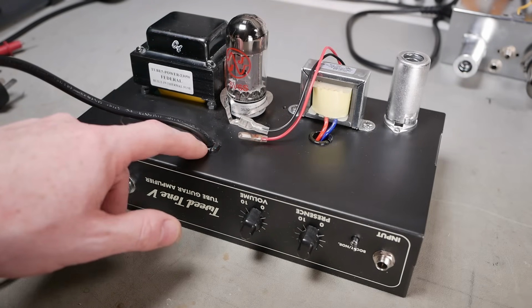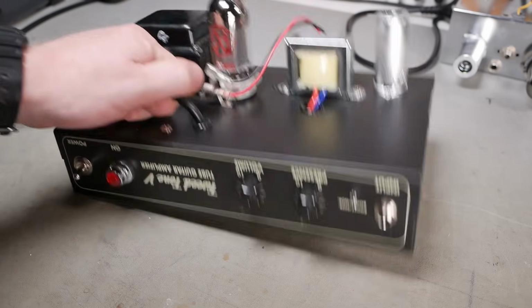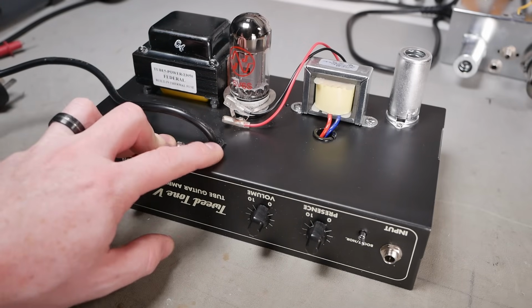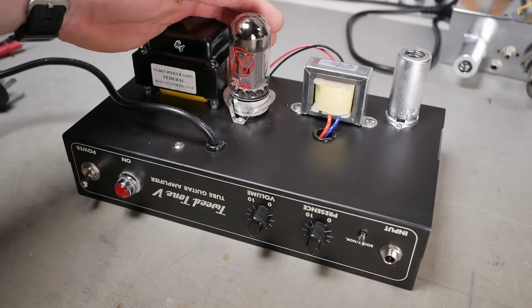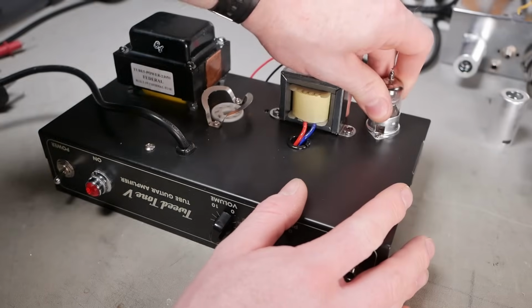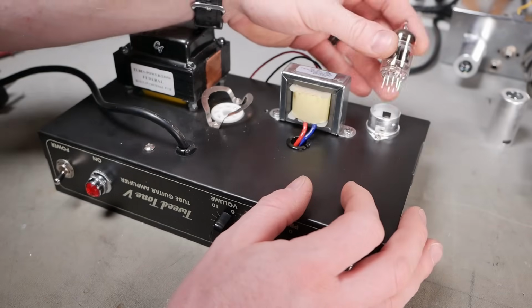Alright, so that's what the fillet out of the baffle was for. They've got a little strain reliever there for the mains. So they must have put that a little bit too close and it was hitting the baffle, so nothing a little chisel can't fix. They've actually got a real JJ's 6V6S. As for the preamp valve, we've got a Ruby 12AX7A.